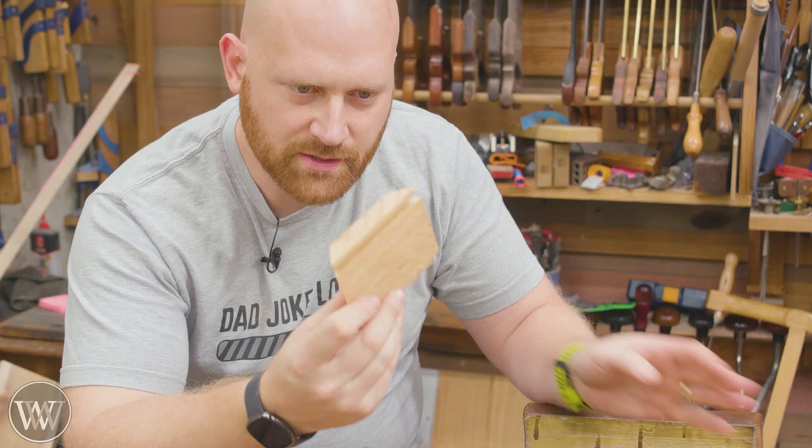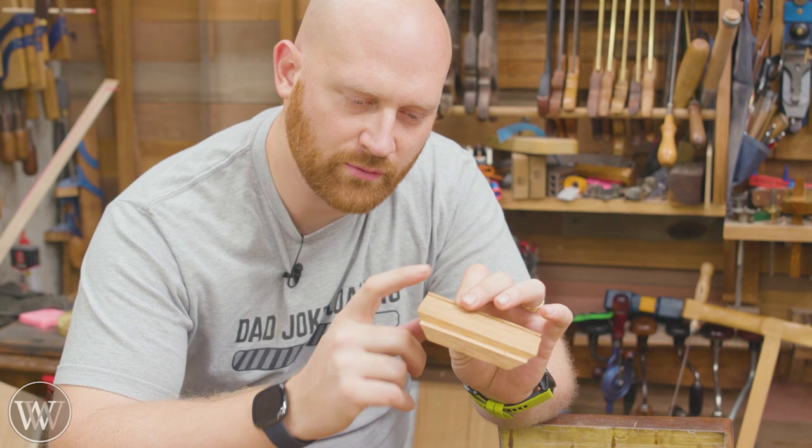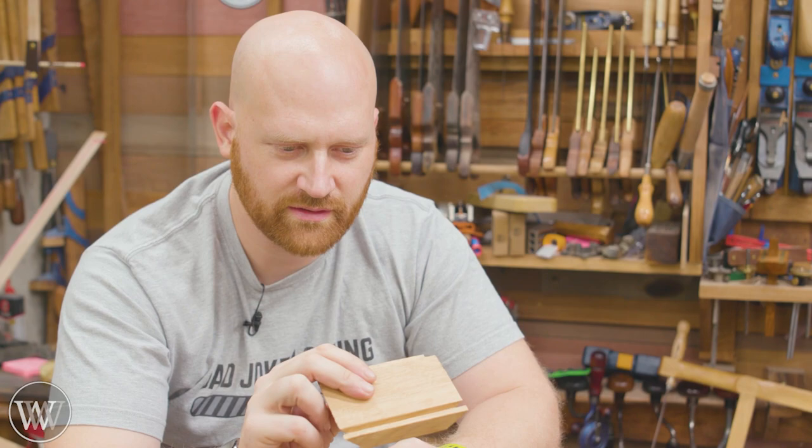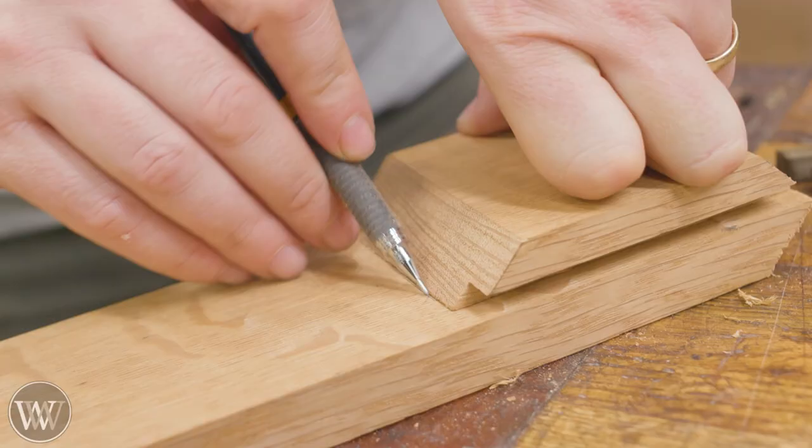I think for the rest of them, I'm gonna do the dovetails first and then run the grooves. Originally, I was going to do them all out of the stick, but I want to make the 45s matching. So if I can't go all the way along, I'll be doing the inside of one and the outside of the other. So I have to do them all individually. And then I've got to make 8 sets of dovetails. This thing's going to be really tedious. That's what I like.